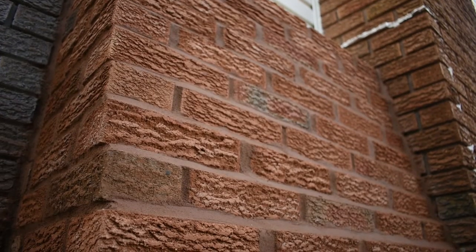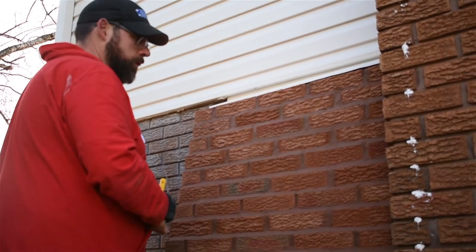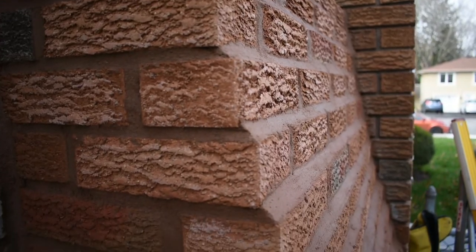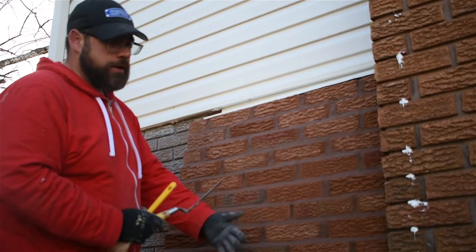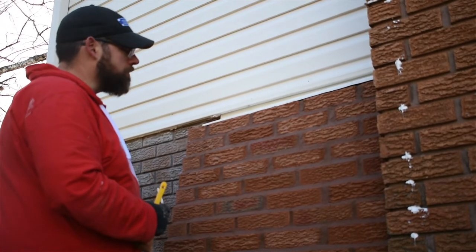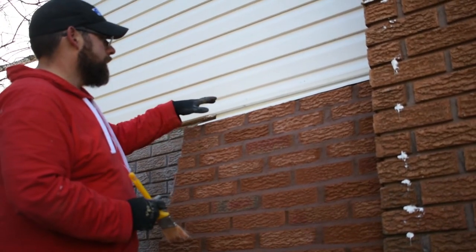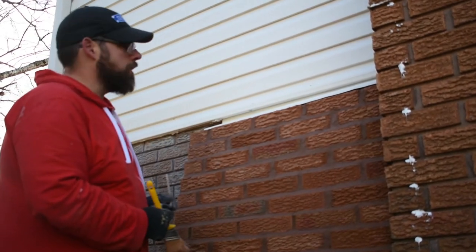I've got all the mortar bevels on, so that way when the water rolls down, it's just gonna shed really nicely down this whole chimney shoulder. When I rebuilt it, I also built it at a slightly steeper angle than before, so the water is going to shed a lot more quickly, so it's not going to sit on the brick, get in, do damage like it was doing before. I'm going to get a couple limestone type sills, and I'm going to put them on the top to cap off the top of the brickwork.